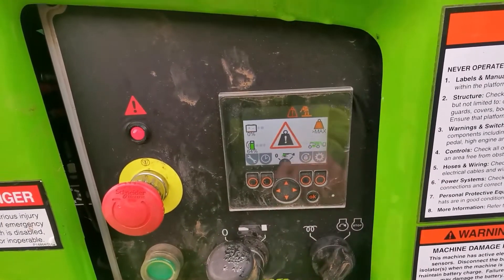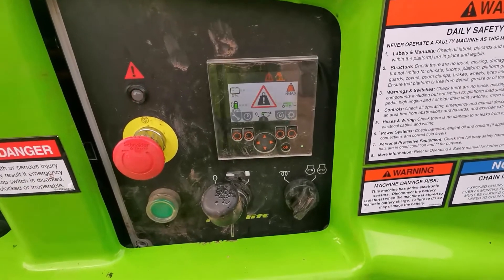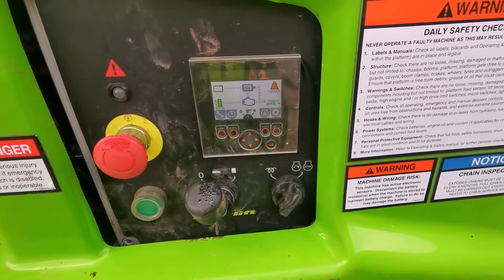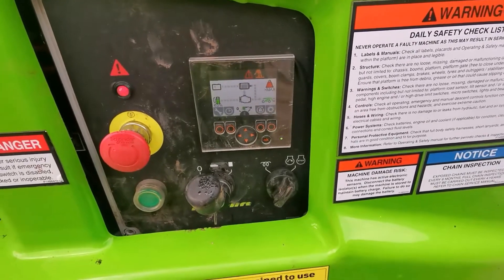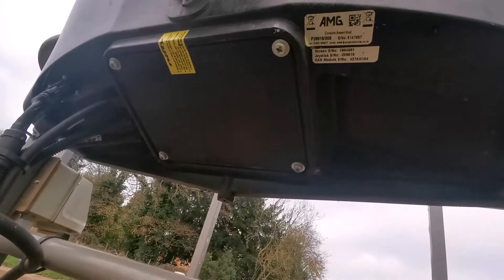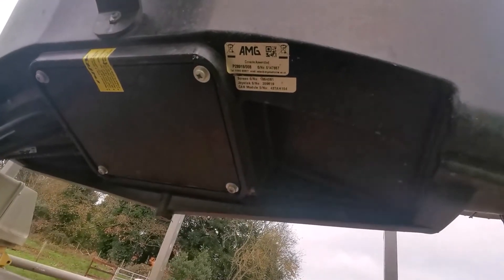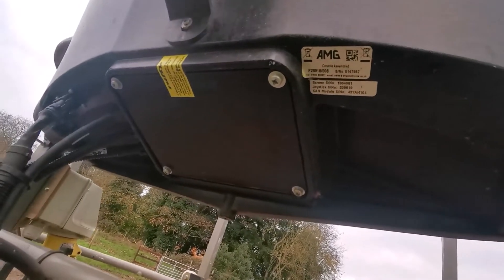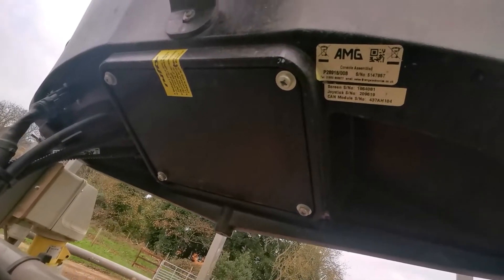So what I will do is have a look around the cage, around the load cell, if there is any damage on it or not. If not, then we're gonna check the load cell and inspect the cage weight board. Under this cover is the cage weight board. So we're gonna have to look into that board - is it flashing any errors or what's going on there.